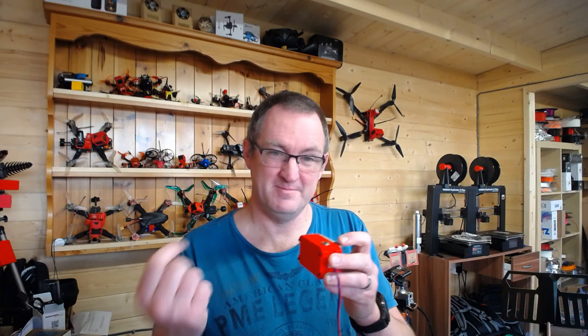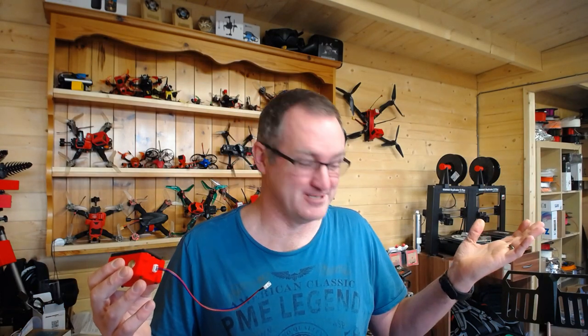So I found myself a little DJT module, which is the old external module — you could probably do this with an XJT, the newer one, but I had a DJT and they work well. I cut out the insides of the board and wired it all up inside. The great thing about these things is they were designed to receive a PPM signal. So all I've done is take a Quantum no-drift head tracker that they sell on Hobby King, wired the stuff in, mounted it all in here, bound it up to the radio, and off it goes. It works perfectly.